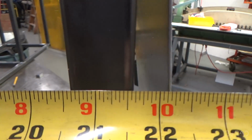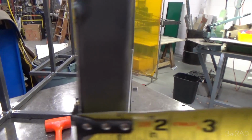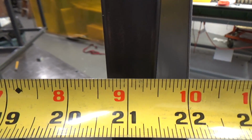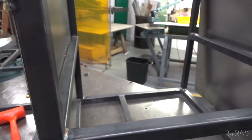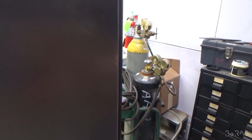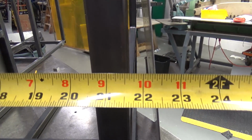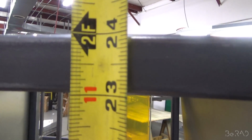That leaves this back piece 21.5, which actually is 21.5 because of the added thickness of that sheet metal there. So 21.5, and then I'm taking off a 1/4 inch overall. So there's basically an 1/8 inch gap, which you can kind of see there. So then it doesn't quite bleed off the edge and give a sharp edge. So we want to go 21.25 by 23.25.